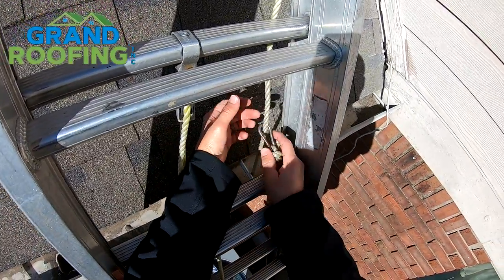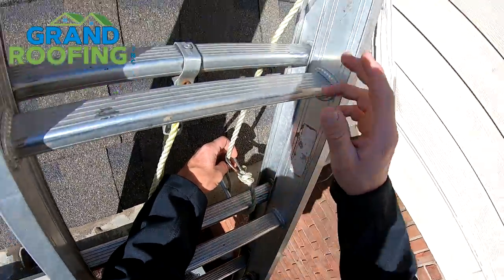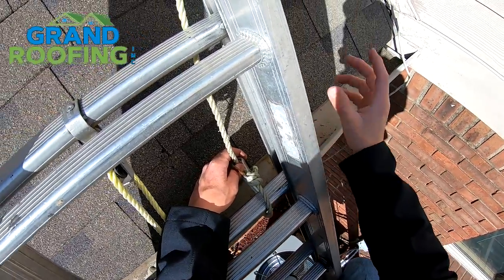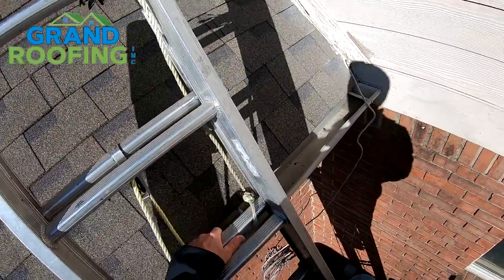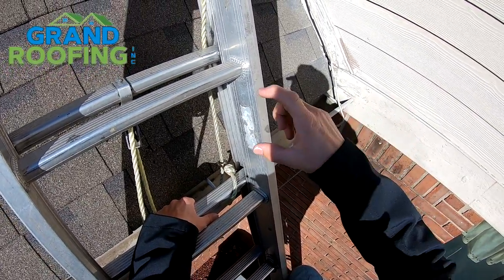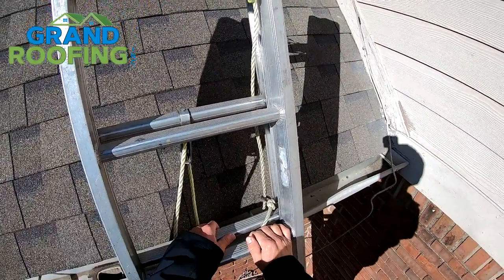A third big OSHA point — and I've had the ladder blow over, which is why this matters — you want to make sure the ladder is roped or tethered. I keep a rope on the ladder always so I never forget it. I carry it to the rooftop and simply loop it around a spike, a fastening point, or an anchor, then go around the ladder and connect it. It's not going to blow away while I'm not on it. When I'm done with the job and carry it to the truck, I have a small piece of rope on the truck rack — pretty secure with a tail end and a loop. All I have to do is put the ladder in and connect this end to the loop on the truck, and I can guarantee it's not going to slide out and blow away — because that, my friends, is pretty bad.